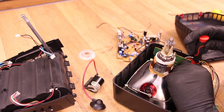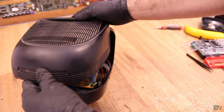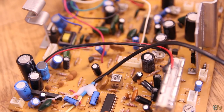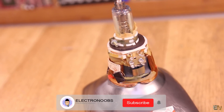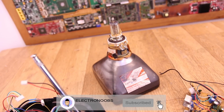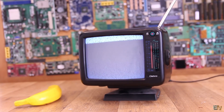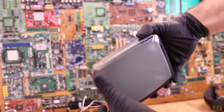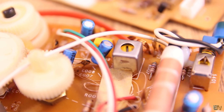So guys, that's how a vintage analog TV works, more or less. I will put below some more in-depth information about each part, but basically we have the antenna to receive the RF signal, then we amplify that and filter it only for the channel that we want, we demodulate the received signals — one side goes to the audio amplifier for the speaker and the other side is divided into the X and Y axis of the screen. That together with the flyback transformer and the cathode ray tube creates the picture on the fluorescent material inside the screen. Now you should know a little bit more about analog TV signals and how this kind of TV works. I hope that this video was interesting and maybe you learned something new. Make sure that you subscribe and activate the notification bell. Consider supporting my work on Patreon — thanks again and see you later guys.